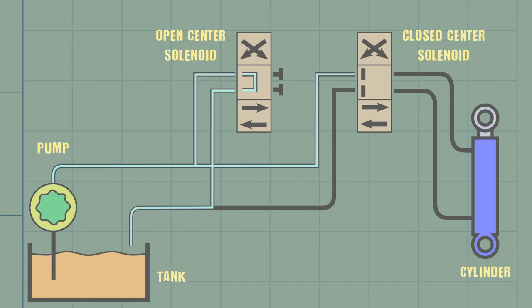This rubber band represents the solenoid that wants to pull it open. Right now the forces are balanced, so the spool's not moving, but if I increase the current on the solenoid, I can move the spool. If I reduce the current, the spool should go back to its original position. But a lot of times, it doesn't quite make it, and that's because there's friction.